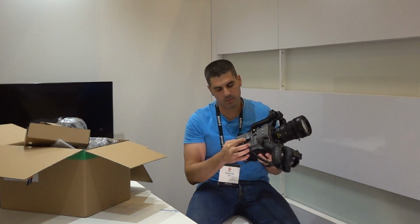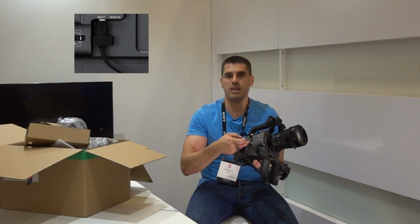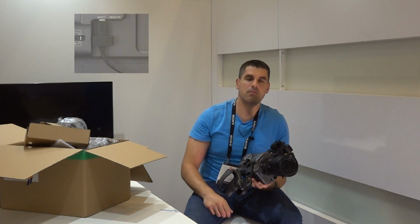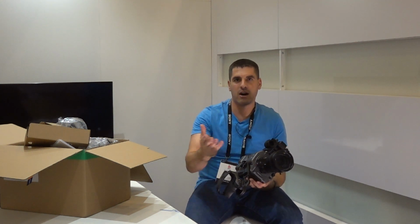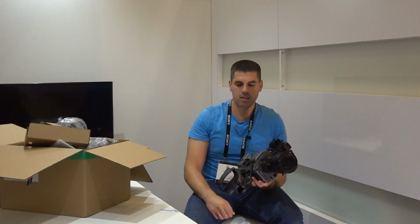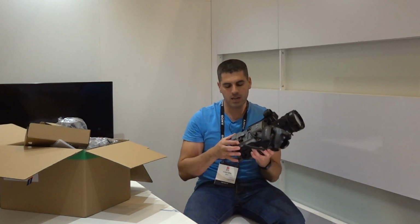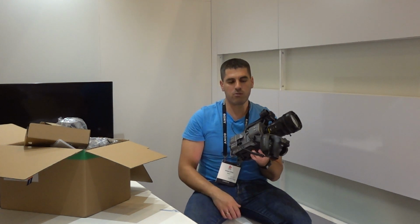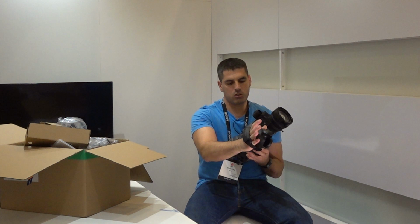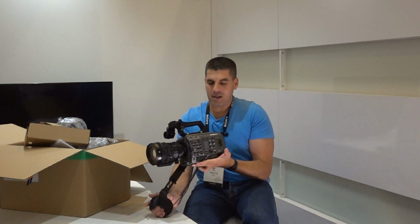Also, the connector to the camera is via USB. You can use the LANC, typical from the FS7, FS7 Mark II, FS5, or RM30BP, any controller which is via the mini jack, the 2.5 millimeter mini jack. But in this case, we have improved the responsiveness of the camera via the USB connector. On the right side, there are many changes.